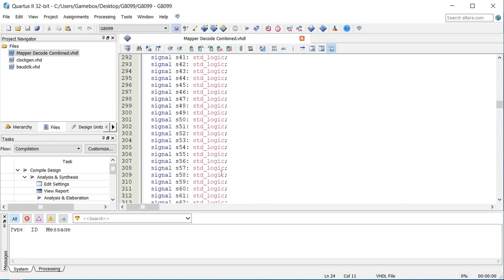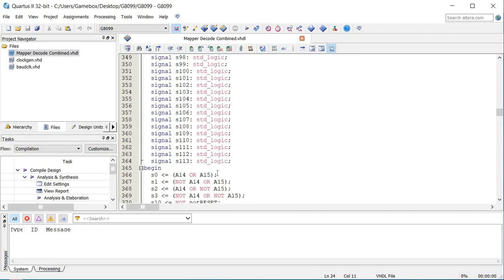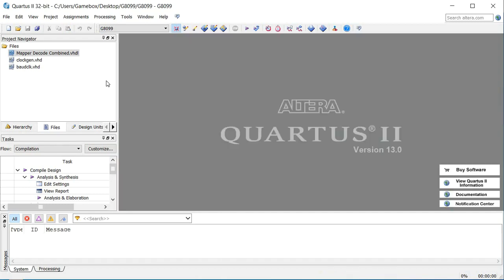Digital does not take into consideration double negatives. What I mean by that — and you'll see once I actually go to compile this — if you have a NOT input that is going to give you a NOT output, it will not give you just a regular high state output. It tries to double-NOT those. And when it comes to VHDL, at least in Quartus, it does not like that one bit. It's not even going to compile. And I'm going to show that to you right now.